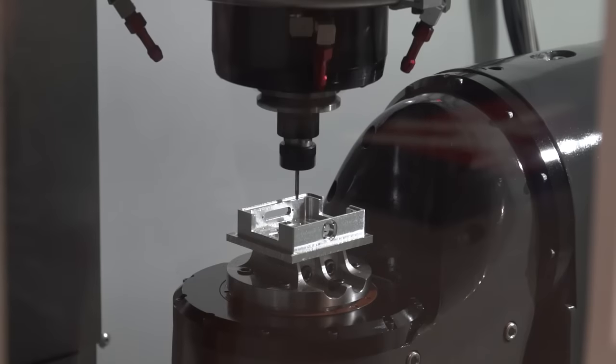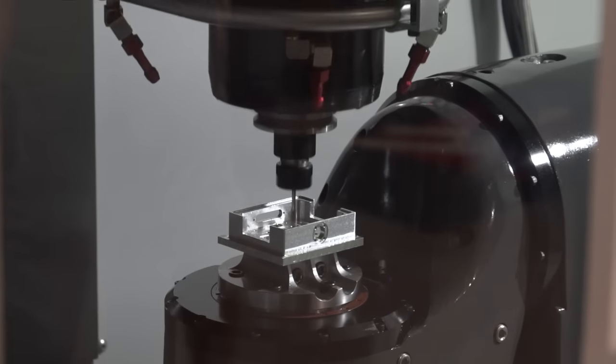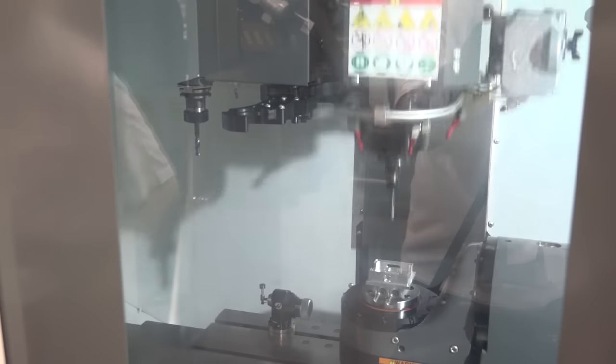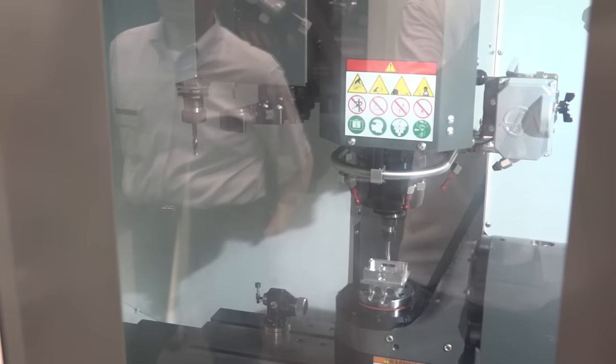How quick is it? It actually has a rapid travel of 61 meters per minute. So for companies that are into production and want to drill and mill parts, this is a very good choice of machine. It fits into a very neat little footprint as well. We're talking here about the DM2, but it also exists as a DM1. If you buy a DM2, you get an extra 200 millimeters on the X-axis within very little floor space, so you can handle rather large parts.